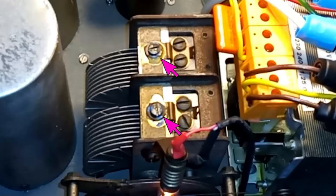On this radio, only the trimmers on top of the tuning capacitor allow to make a basic alignment. Nothing else, neither the coils, can be adjusted. To make the two parts of the main variable capacitor tracking together, the external blades of the capacitor could be bent, which has been done already originally.